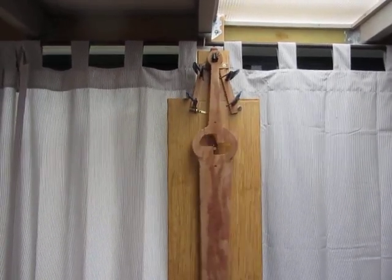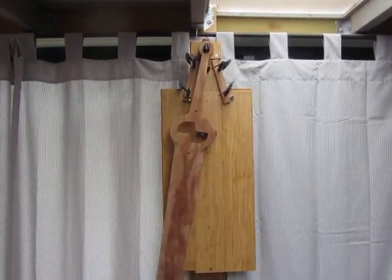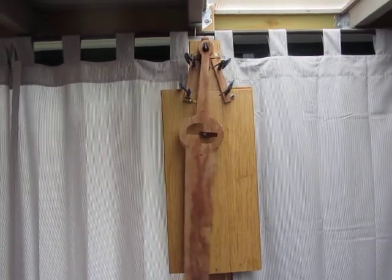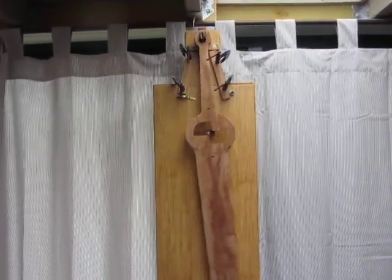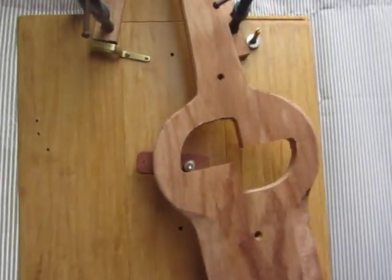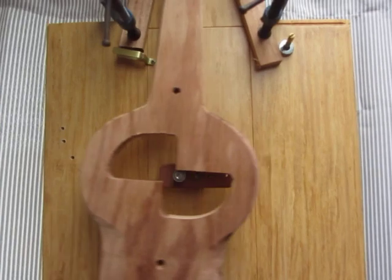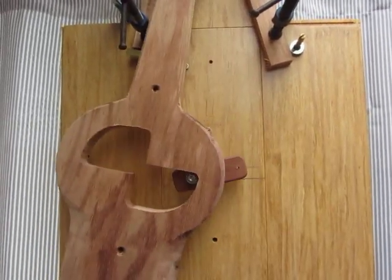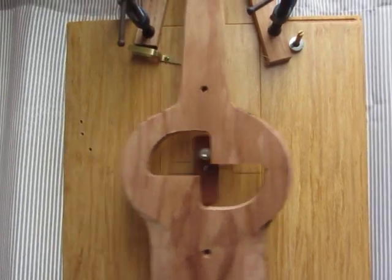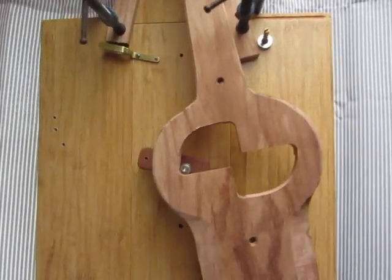Well, this is another experimental escapement. This is Mr. Charles McDowell's 1851 patented single pin escapement. It's not very efficient. The driving pin only gives two impulses per revolution and I think there's a lot of shock waves going back through the gear train. But it works. Rather simple and unsophisticated.